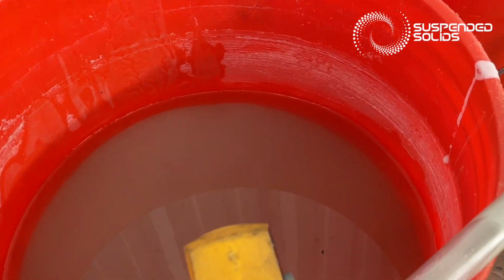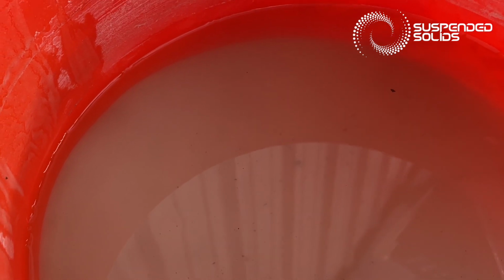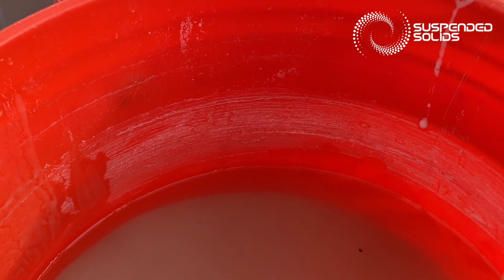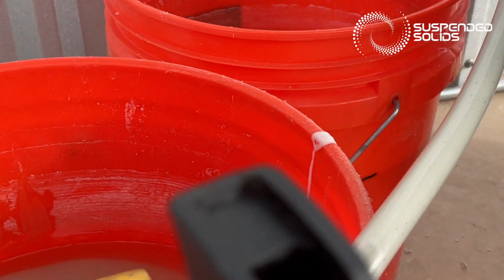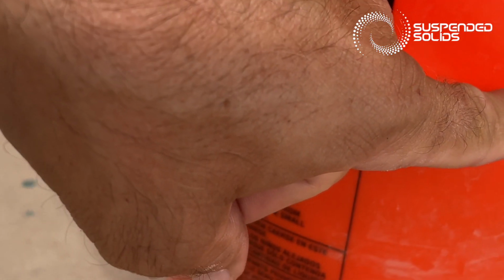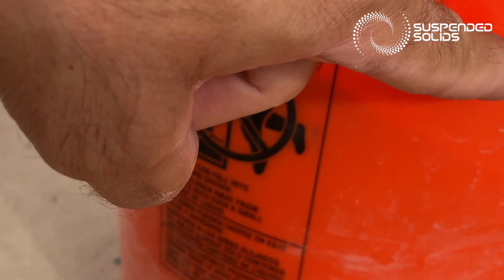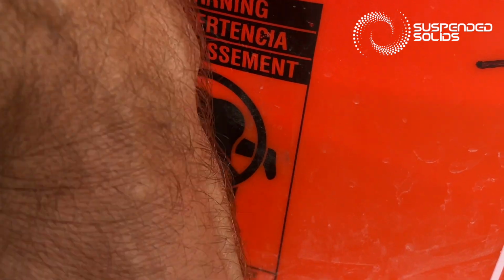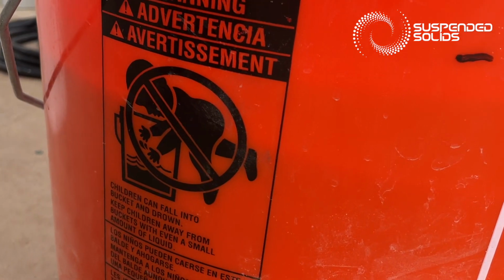As I mentioned, I put a little clamp on the catch basin, and you can see coming out is nothing but pure glass. Very little water is in the catch basin. I actually lost a little bit of glass because the hose came out as I was running the test. But if you were to take a look on the side to where I made the mark earlier, you're going to see that the current slurry level is about here, and 100% of the media being removed is here. Now, it fills a little unevenly, so it takes a few shakes sometimes to make sure the level is correct.